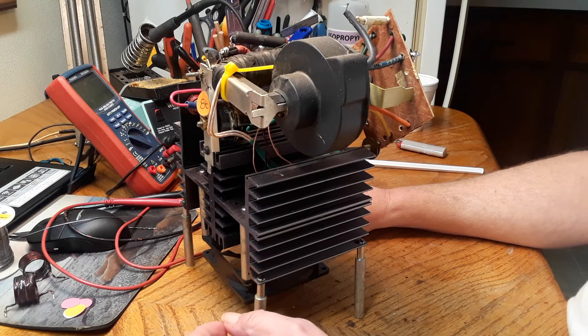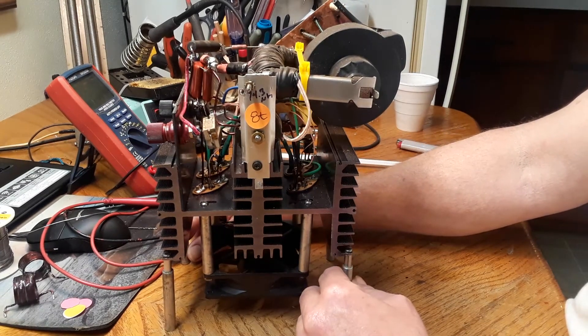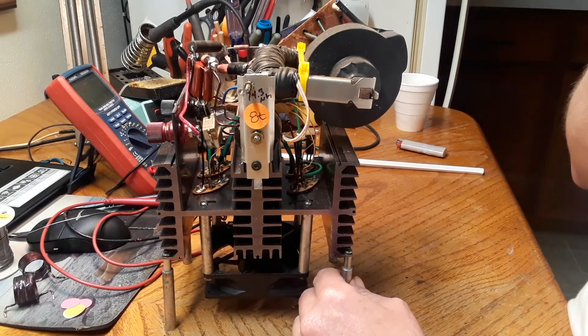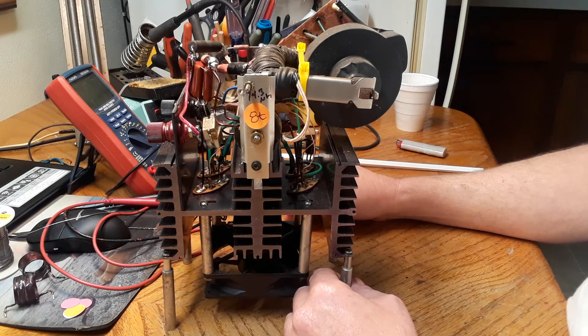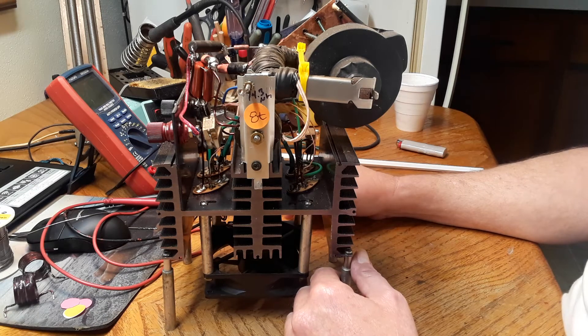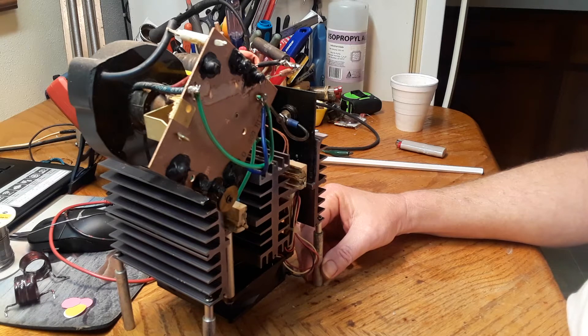The DC resistance of the secondary is about 715 ohms, so it's a pretty big beefy secondary. This is all wound with litz wire, though litz wire doesn't really make a difference here. You can use standard magnet wire — I've normally used 14 gauge for winding primaries and 24 to 26 gauge for base drives, and found it absolutely no different than messing with litz wire. But that's just my personal opinion.